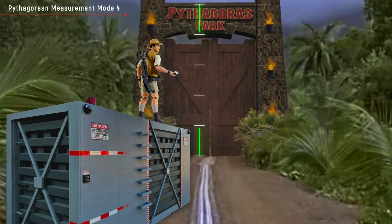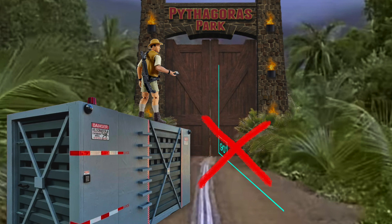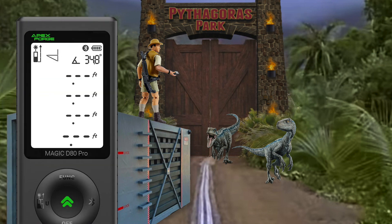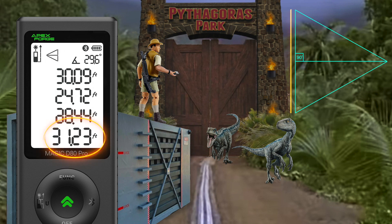Finally, we need to know how high the top of the archway is from the ground, but this time we can't shoot at 90 degrees along the ground since the velociraptors are loose and they're hungry. The solution uses two 90-degree triangles to determine the overall height and does the math of adding them together for us. We start by pointing the laser at the top of the arch and measuring that distance. Next, with the laser pivoted down to 0 degrees at a right angle to the gate, we take the next measurement. Finally, we pivot the laser down and point at the bottom of the gate. The display shows us the total vertical height from the ground to the top of the arch, and the measurements used to calculate this are shown on the screen.